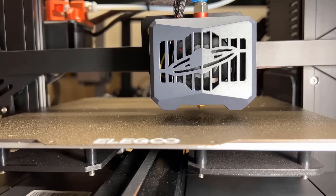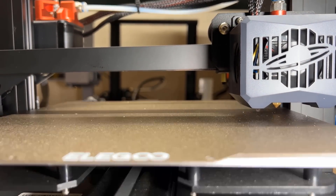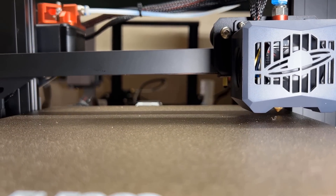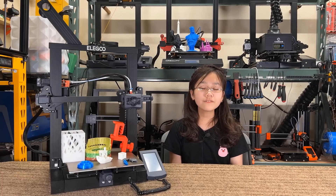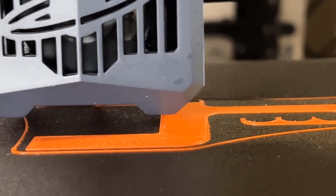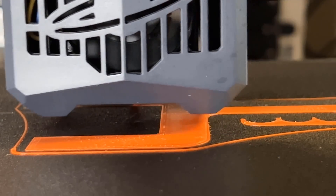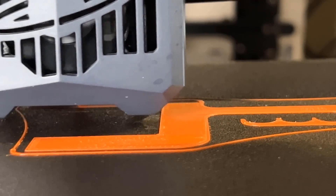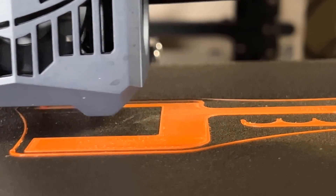Six, the strain gauge works pretty well, and as the print bed is supported by spacers, it won't move like the beds that are supported by springs, so you only need to do auto-bed leveling once in a while. I did all of the test prints without re-leveling the bed and had no issues except for when printing with ABS. When printing with higher bed and nozzle temperatures, I should increase the Z offset to make the nozzle a little bit further from the bed to compensate for the heat expansion, but I forgot to do that, and so that was the only print that did not have a perfect first layer.